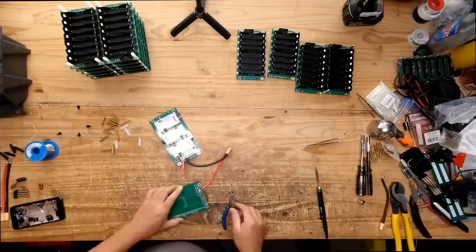I'm basically putting that last board together with those connectors. And then after that, we should be able to put that battery pack together and load test it. Were you concerned about the soldering fumes? Not because I don't do that often. I actually don't solder very often anymore. But if I were to do a large amount of these boards, yes. We had one here yesterday. I have little extractors with a charcoal filter that grabs all that nasty stuff and keeps it away from your face. If you're building a large amount of these, just make sure you use an extractor.